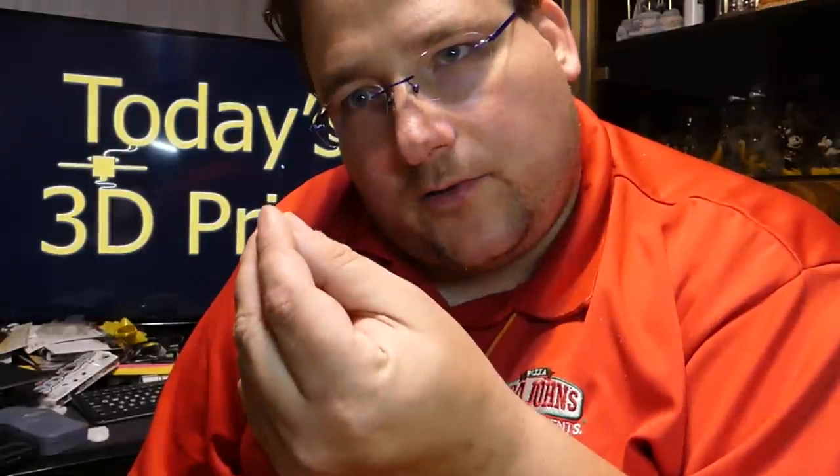So what that means is, let's say I have a 1 millimeter retract. So I pull back 1 millimeter, and then I push forward again a millimeter to get me back to zero. But I have it set for a negative 0.45 restart, which means I pull back 1 millimeter, but only push forward 0.55 millimeters. Okay, now if you draw another 20 millimeters of filament, you're fine.